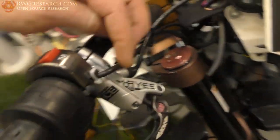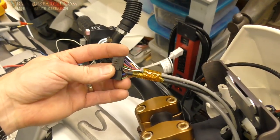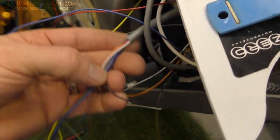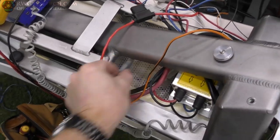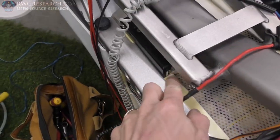I actually rewired the kill switch with a brand new wire down to the bottom - the factory one wasn't long enough. Then I got the throttle control wired in here, and then I have a regular cable that's really durable stuff, which I wanted. Got that all wired, going to the keys, and got that wired down here to the solenoid, and then wired over to the battery cable. The USB connector comes all the way up here.